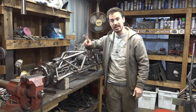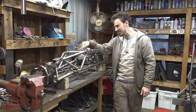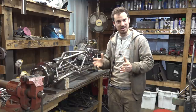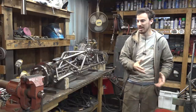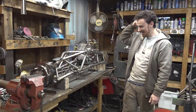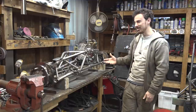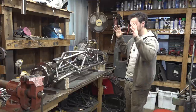I don't think the axles, what we just welded, I don't think that's the weak point. I think the weak point with this setup is these differentials. These differentials are for a Polaris Magnum 325, a 325cc ATV that produces a whopping 30 horsepower, and we're trying to push 75 horsepower through this thing with a heavier vehicle and bigger tires. I don't really think that these are gonna hold up, and I'm doing an awful lot of work setting this up when I honestly don't really think that they're gonna survive the first test drive. But we'll soon find out if these work.